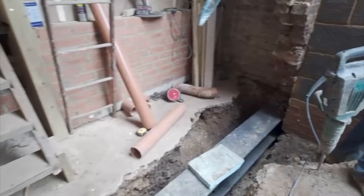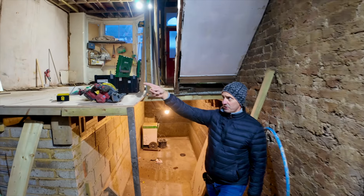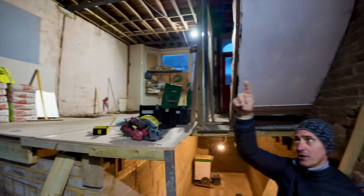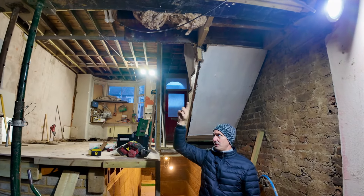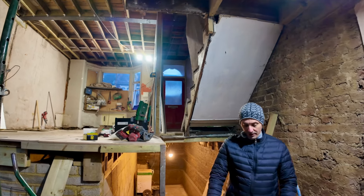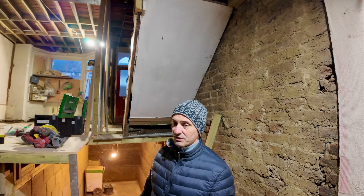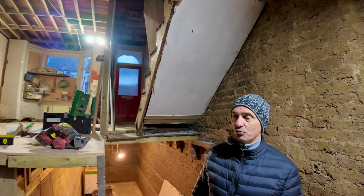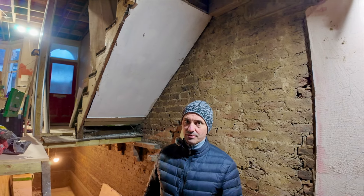This is a very massive steel — 254x254 by 89kg — very massive, with a post. This is called a frame beam, and this steel supports most of the house; 90% of the house is supported by this L-shaped steel with a crank beam. It's sitting on that beam post and on my steel which has been set in concrete with mesh. Steel is 800–1000 pounds a ton for basic; with prefabrication and delivery it's 2200–2300 per ton, and going up.